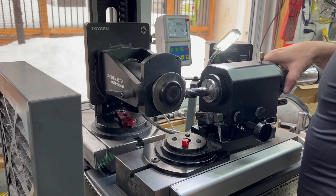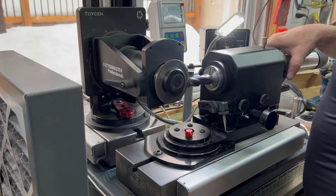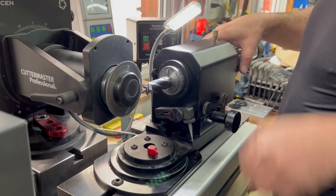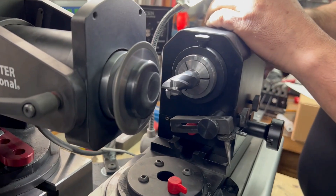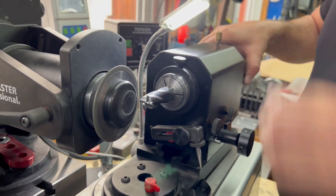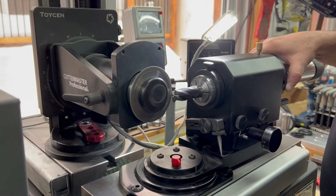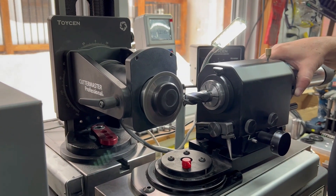The benefit of being able to do this grind is that it really doesn't lose its shape. By tipping the motor back, we don't actually take out that top corner. Coming across it allows us to get all the way to center, so you can make a nice center-cutting end mill.